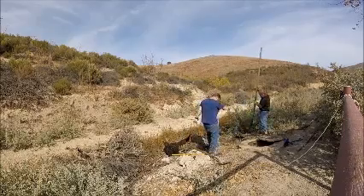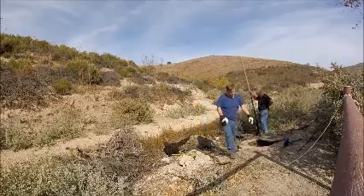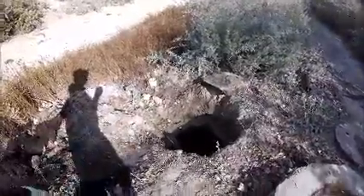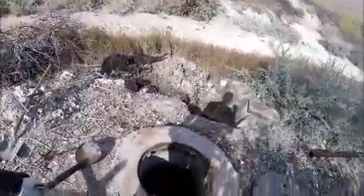That pipe is taking up seriously less room than that root ball was. We've scooped out the liquid section and came up with about 300 pounds worth of root material, soaking wet. That tank is pretty clear now — it's just some basic waste. So we really feel that the root killer will definitely handle what's left in there without having to deal with all this bulk. Feeling successful, we're going to tackle the other side now — the collar is going to complicate things a bit, so we got our procedure perfected on the easy one first.